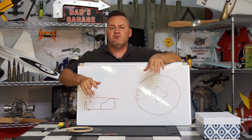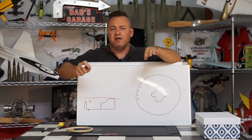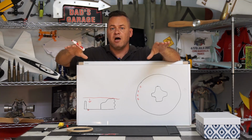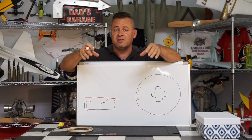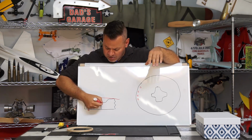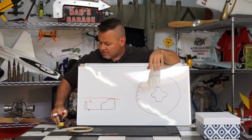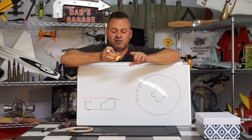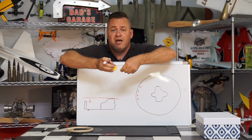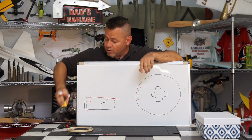The reason we want to do this is that it draws the plastic out and thins it out, as it's being stretched this way. It stops all that extra slack from the plastic being soft and malleable to create webbing. So as it gets closer to the mold, what will happen on the insides right in here as it's being drawn in, because the plastic's fairly soft, it'll actually suck together and create a web. And we don't want to do that.